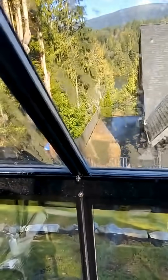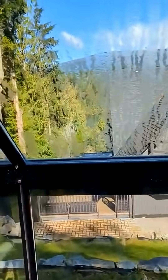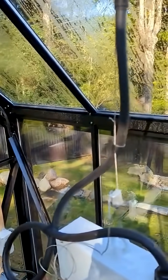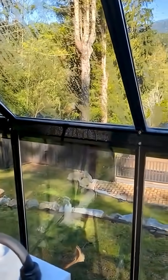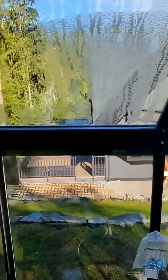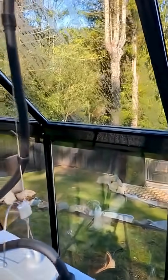The way to alleviate that is having a circulation fan going, aiming towards the roof while your heat's on — that should keep it as dry as possible. It's not a perfect fix, but with a greenhouse like this it's not thermally broken, so you're always going to get a little bit of moisture inside.